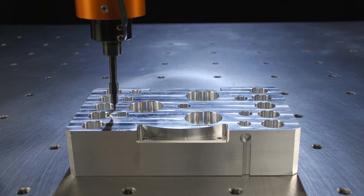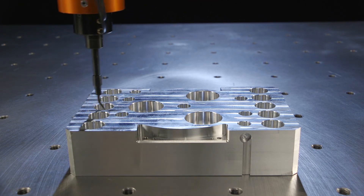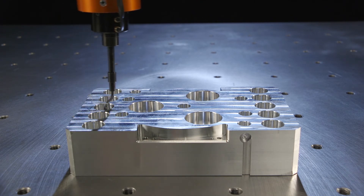What are the unique benefits of the CDB? The compliant deburring blade unlocks automated material removal for thermoplastics and unfilled thermosets. Traditional and high-speed spindles can often melt plastics or burn thermosets. But since the CDB does not use a motor, it can move slow enough to not degrade the materials. The lack of a rotary spindle also reduces the chance of chatter in tight features, such as tight interior corners or small diameter holes. You can countersink holes under a half inch diameter without ruining the part finish.